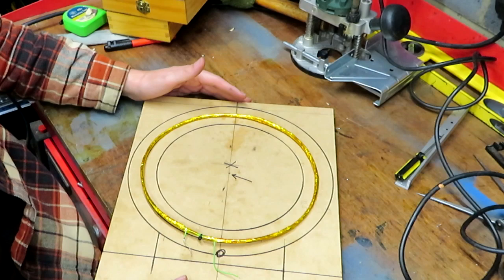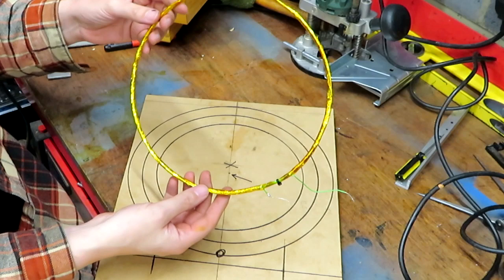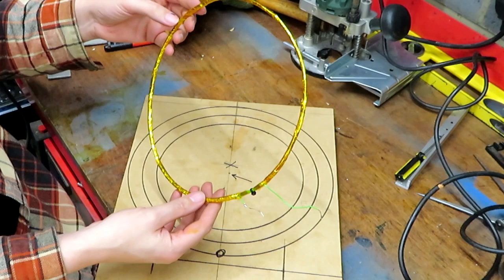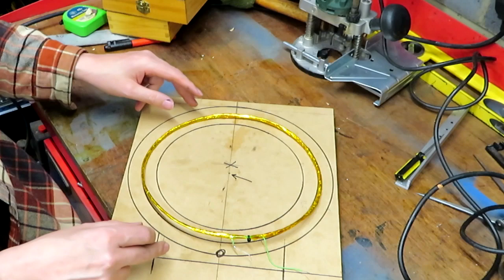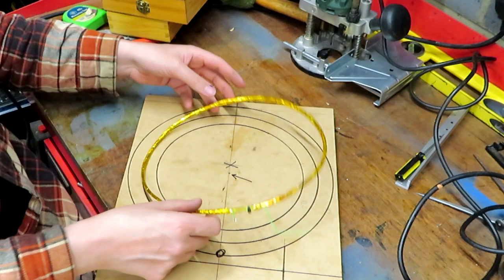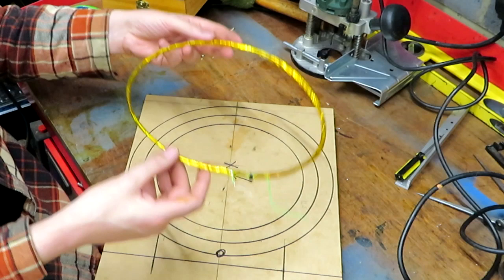But there's hundreds of different ways that you could actually make a support for this loop antenna. And in fact, perhaps you wouldn't even need to make a support for it at all. I mean, if you bend it slightly, it really isn't going to alter the performance very much, but you don't want to squash it completely out of shape. So of course you could just glue it or cable tie it to a piece of cardboard for support, and that would work absolutely fine. I also know that Simon Spears has a loop antenna glued to the underside of his bench. So that's something you could do as well. You could just glue it to the underside of your bench, and then it's out the way, isn't it? So that seems like quite a neat and novel solution.